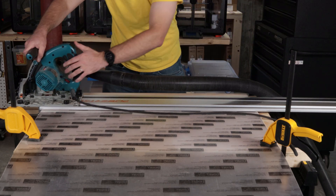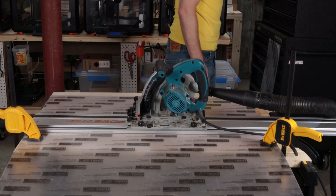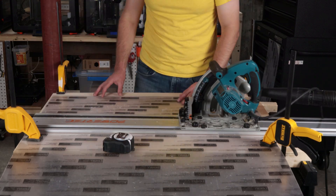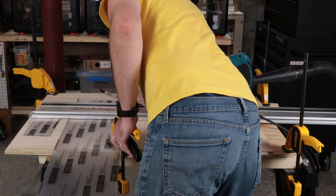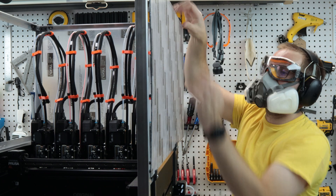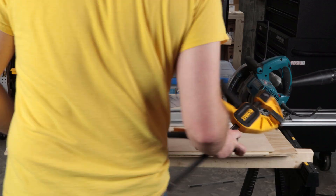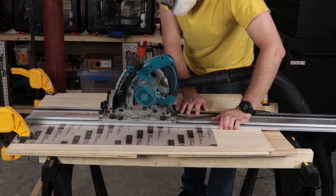This was my first time using a track saw and it was great. I don't own one but I borrowed it from a friend. It has two key features: first, the track itself helps hold the polycarbonate in place and gives really nice straight cuts. Second, and critically, it has variable speed — I was able to slow down the rotational speed so it cuts the plastic nice and slow, leading to really good quality edges. As a reminder, wear your PPE — I used a half-face respirator mask to avoid inhaling fine plastic particulate. After each cut I did a test fit, and in a couple of instances I needed to remove a little extra material to make it fit nicely and flush. The track saw could easily take off just half the thickness of the blade to knock off a few millimeters.